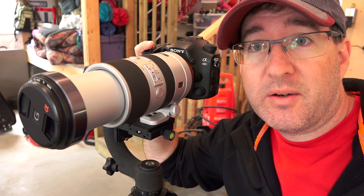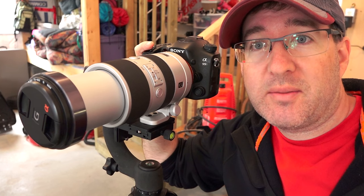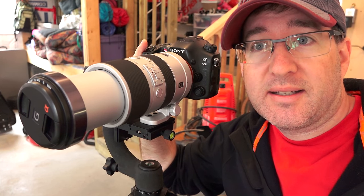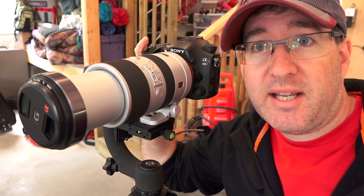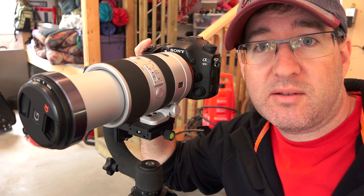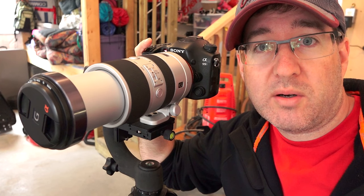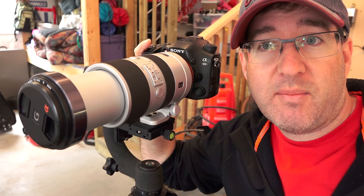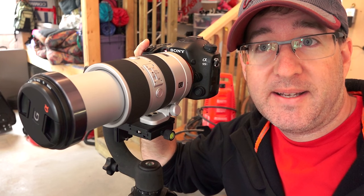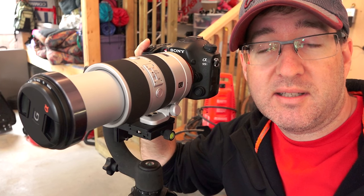In conclusion, if this is something you want to purchase out of the box and use, you're probably not going to be happy with it — there's a lot of slop and play. It is a good price at $65 American. But if you're a handy guy, 15 minutes and you can do the changes I did: very simple — adding some grease, doing a bit of a clean up, putting in a nylon bushing, putting in a rubber spacer or a piece of compression spring. 15 minute job and this feels a hundred times more responsive — no slop, no play. All in all, I would give it a thumbs up. It's a good product if you want to spend a little bit of time to tighten things up.